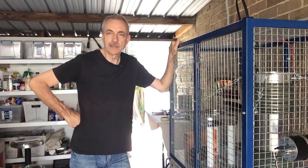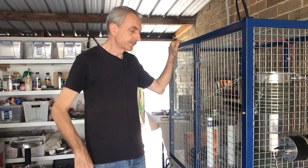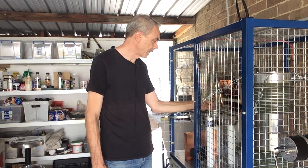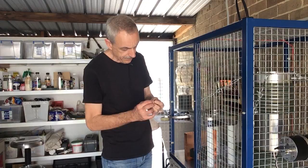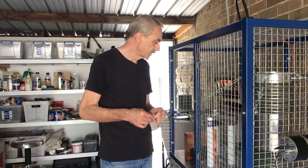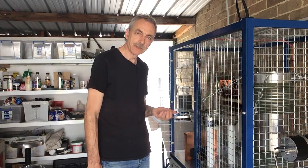Okay, so here we are again. The outcome of this experiment wasn't any different from any of the previous runs — it ended up with some of the electronics blowing up again. What happened is the op amp in the receiving end of the pulse width modulator blew up completely. I've got two LM op amps here and both of them are burned right off. The disadvantage when that happens is it blows and opens the valve to the gas, so I basically lose all the gas in the sample cylinder — a bit of a waste of money as well. And there you have it, another unsuccessful experiment.